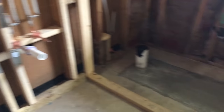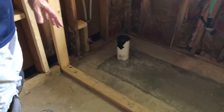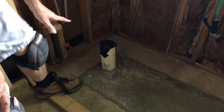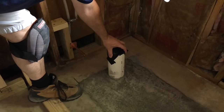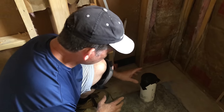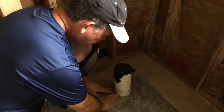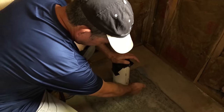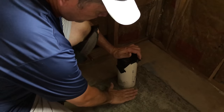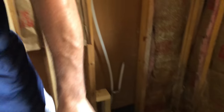We'll start over here. The plumbers have already done their work. We've had it inspected and yesterday Jordan and I backfilled and poured the concrete. So the toilet used to be here — they swung it over here. One thing I want to point out: they used 4-inch risers, so that's going to make it easy on us when we set the flange. We can tile right up to the pipe and finish the floor.